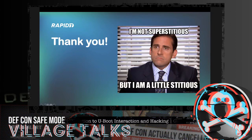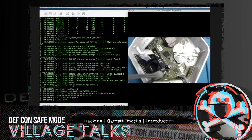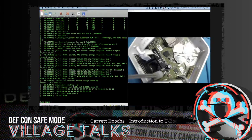Yeah, there was one more question I saw come in the chat. It said, did you download someone else's build for the Luma or did you do it yourself? In this particular case, I actually built this a while back while I was doing some testing on the Luma. I used OpenWRT's program. This is built off an IPQ40 series processor, which is the processor on that particular Luma, and it's one of the chipsets that's actually supported within OpenWRT.